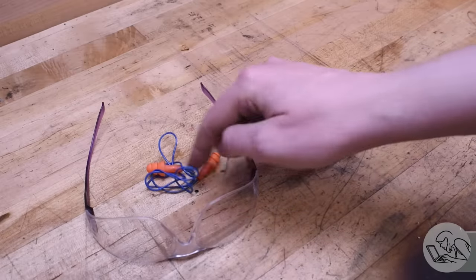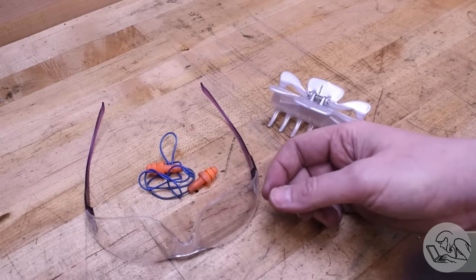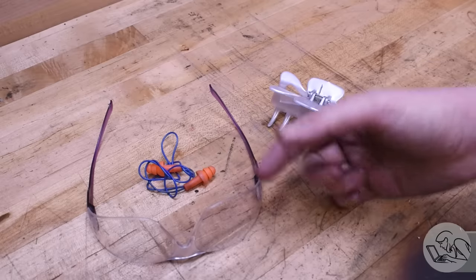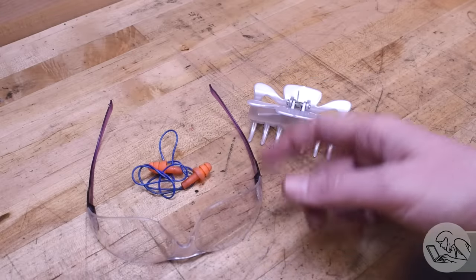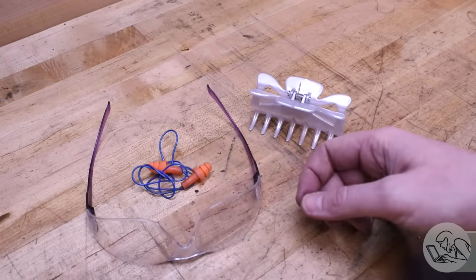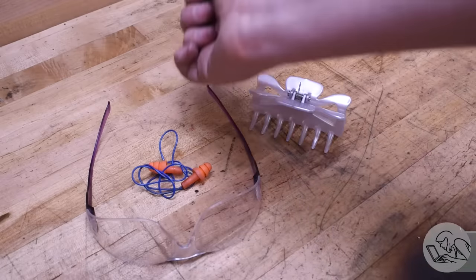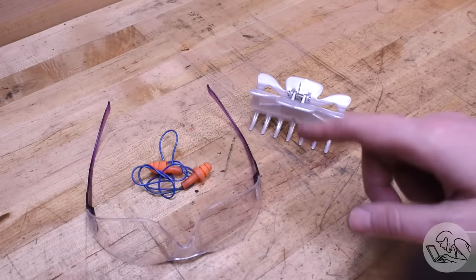Also important but less commonly used in the machine shop are earplugs. The truth is machine tools are mostly pretty quiet - it's one of the reasons I like machine shop work over, say, woodworking, which as I always say, woodworking tools are screaming banshees of dust and death. But occasionally certain materials or operations get really squealy, so it's good to have earplugs to protect your hearing. If you have long hair, a way to tie that hair up is also non-negotiable PPE. All of the spinny bits in machining are exposed and you're frequently working close to them, so you've got to have your hair out of the way - no long sleeves, no jewelry, nothing like that. Those machines are always trying to murder you, so don't give them the chance.